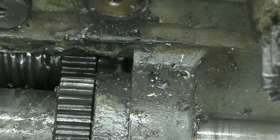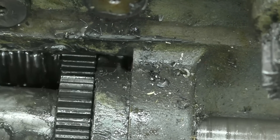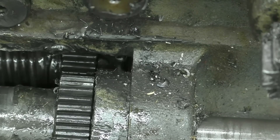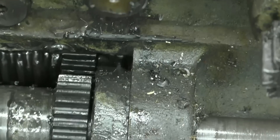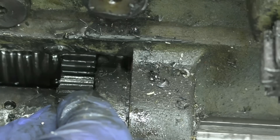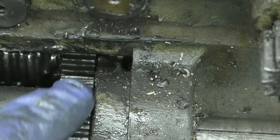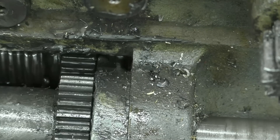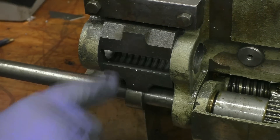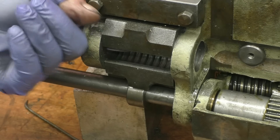You should see the torque gear down there — that's the one that's driven by the feed shaft, and that's the one that drives the worm in there. When you lift it up, it puts that into drive and that's what drives the power feeds. I'm not 100% sure about that but I'll try it — see what possible harm it can do, because it's not a helical gear, it's just a straight spur gear. That's a closer look at the half nuts engaging the lead screw. That's proper engineering — nothing Mickey Mouse about that.